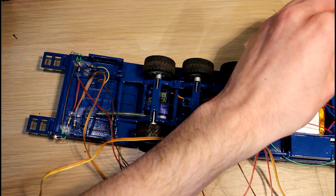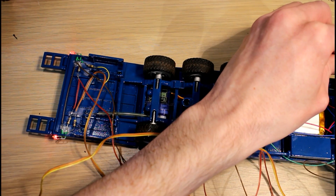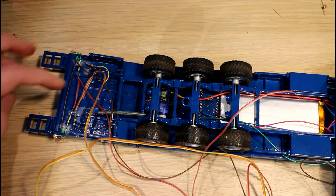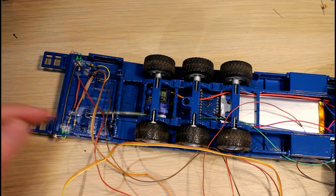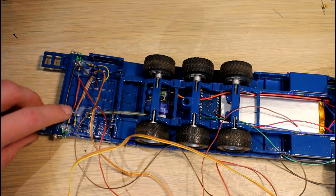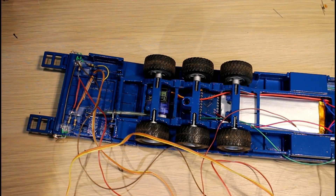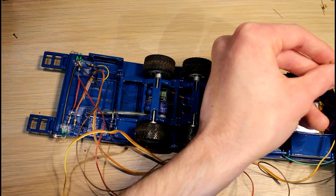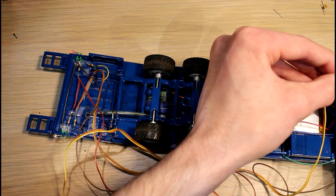This should be the red lights — so that's our rear tail lights. I have a resistor on each of those red LEDs and that comes to a common wire, so you can see there's one resistor and the second resistor connected by the red wire here, and then just one wire continuing forward. The ground wire of all the LEDs is connected there as a single wire going forward. And then our indicator LEDs — we have a resistor on each. They come into two individual wires, and if I light them up you can see one of the LEDs shining through the clear plastic of the rear red LED, and here's the other one on the far side.